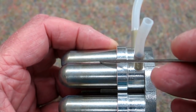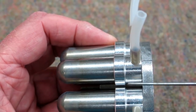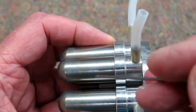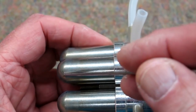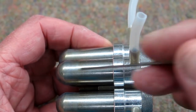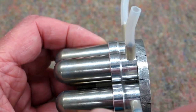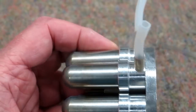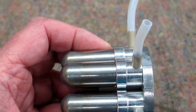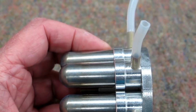The silicone tubes connect to the area that's external to the displacer. So the displacer is not a piston — it travels back and forth and there is some air flow on either side of it. The job of the displacer is to help direct the hot air to the piston and then cooler air back to the hot end to be reheated. That displacer is going back and forth all the time, and there's a very fine line between where the hot air stops and the cool air starts.